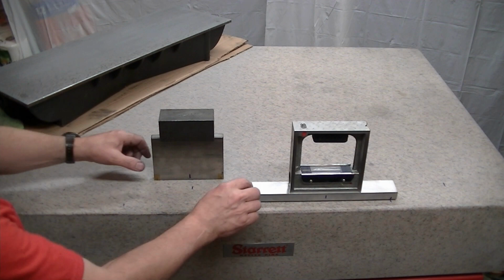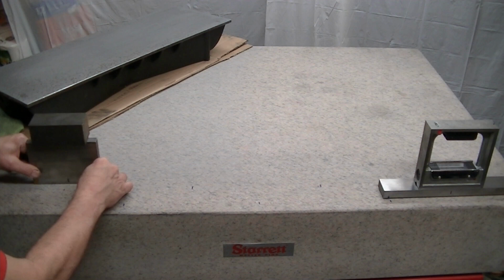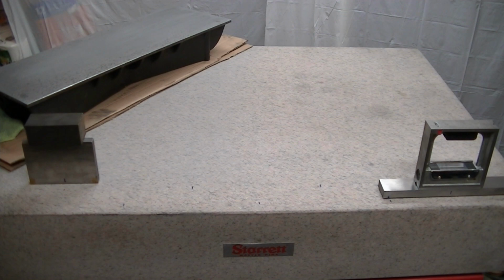Next move, I'll do the same thing. I'll go out to here, and I'll come down to here, where the center of gravity of that is this. And that is minimizing the deflection of the plate because of the weight variations. Remember, the pads that I put on here are pretty well designed to minimize the squish of the pads with the change of weight on the plate, but you still have the deflection of the actual metal frame. Everything moves with any changes of forces whatsoever.